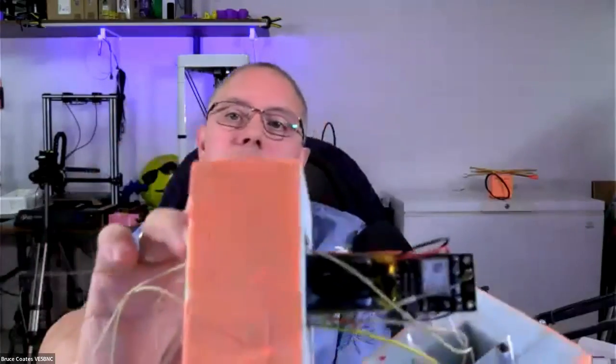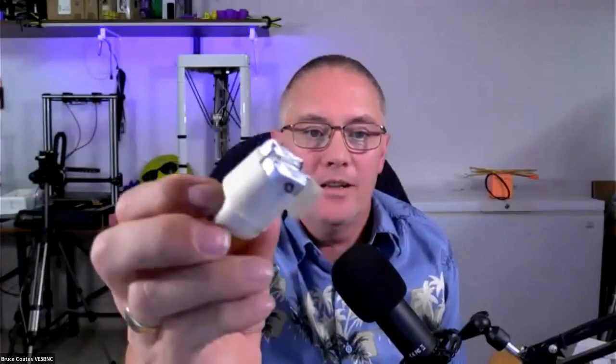Bruce, could you say a little bit more about the size and type of battery you're flying? Oh, sure. We are flying, let's see if I can show on there. Boy, it's black, isn't it? There we are. There's a couple of unused ones. They're just a lithium flat pack. We do also use the cylindrical ones in some of our payloads, the 18650s, but these are a 900 milliamp hour battery in this one. The little tiny beacon or tracker is, I think, 120 milliamps.